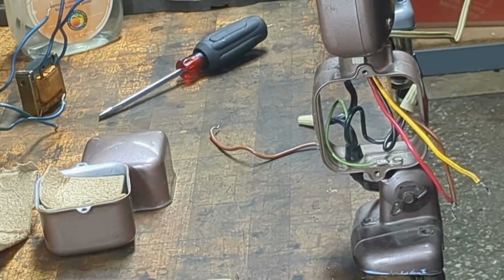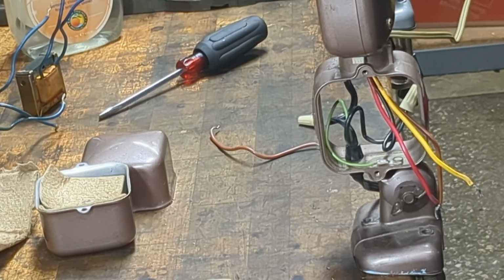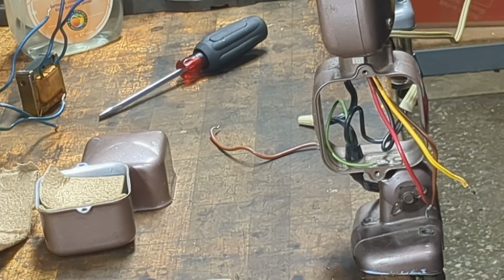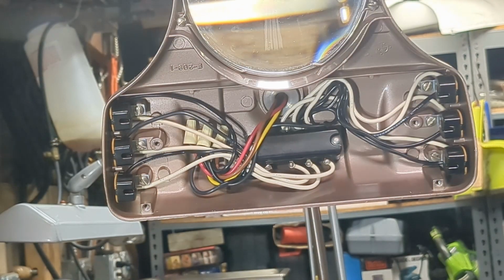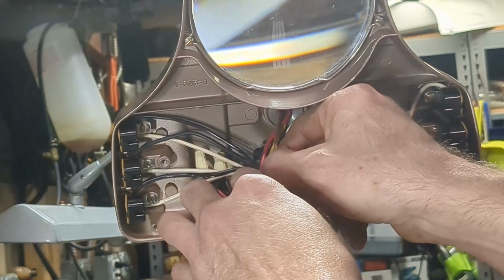So ultimately, we really only need one power lead going up to the lamp, and we will connect that hot power lead to each of the 3 light bulb tombstones, and then connect the ground to each of the 3 light bulb tombstones, and only at one end. And that's about it. It's actually quite a bit easier than the wiring that you see on this lamp. Let's start unraveling the mysteries inside the top of the lamp. We'll pull these out first and just take a look.